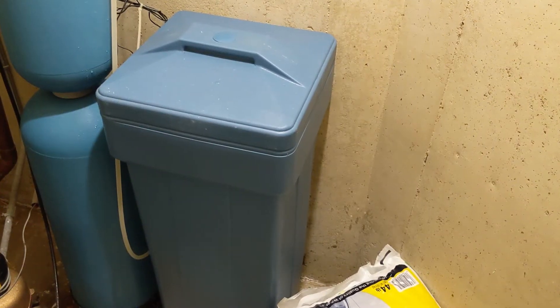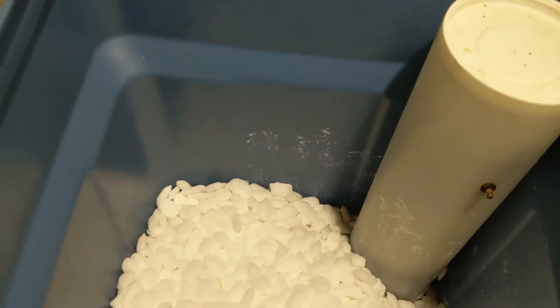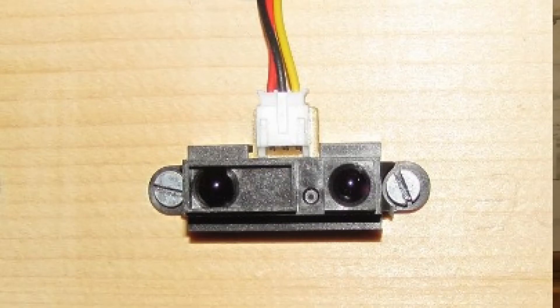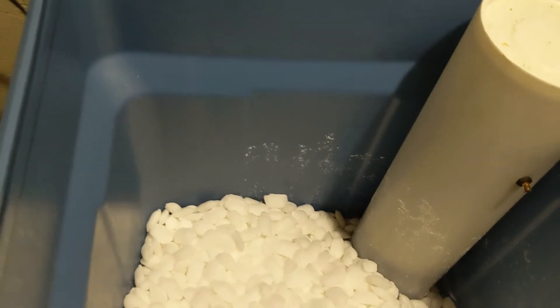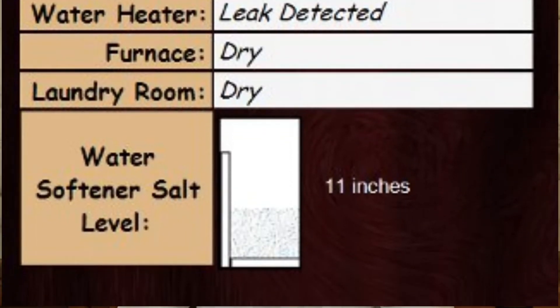Here's one of the more advanced ideas — I have a specific article on the website, so check out the links. We have hard water so we have a water softener, and I would always forget to fill it with salt pellets. What I did was install an IR sensor pointed down from the lid of the receptacle at the salt to measure the level. That allows me to send out a message when my salt is getting below a certain level, reminding me to fill it up.